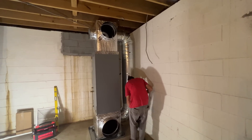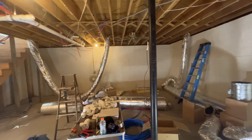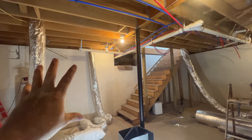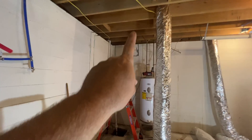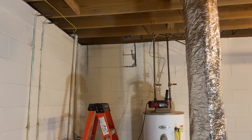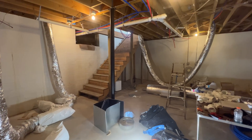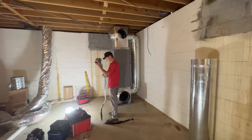It's basically just to make sure we are moving enough air — it's more of a fail safe. Hopefully it doesn't get used at all, but it's in there if we need it. We've got some supply vents coming down. They're getting ready to run the main trunk off this zone here, which will catch everything in this area. The crawl space on that side, which is the original part of the home, is going to come off this zone here. I'm in the process of cutting out the block wall right there — it is solid block and it's a pain, but it's got to be done.